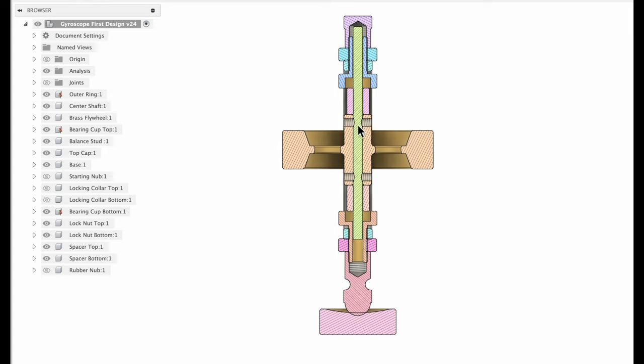So there's four set screws that are going to lock onto that shaft from the flywheel and hold that in place. And I'm going to go ahead and put a little groove in the shaft just to make sure that even if one of those set screws comes a little bit loose, it can't just move off of there. Very solid on that. Going to ream the hole through the brass so it should be a nice tight fit.